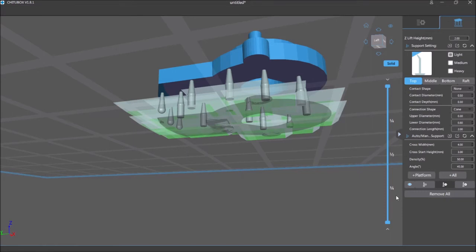So it's actually going to print this first, and then it's going to build up more plastic as it goes, and then eventually add those supports, which then it'll start adding everything else that's underneath the supports to continue printing until it ends up with a finished item that I will take off the print bed. I would break off these little support tabs. I would put the item into an alcohol wash to clean off any loose resin. And then I'll put the item into a UV chamber to let the UV lighting harden the resin.